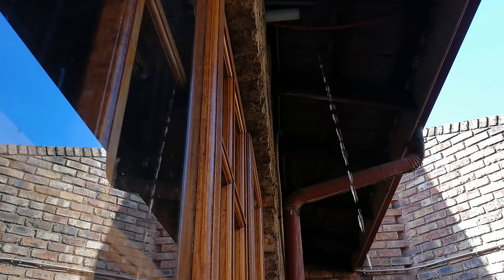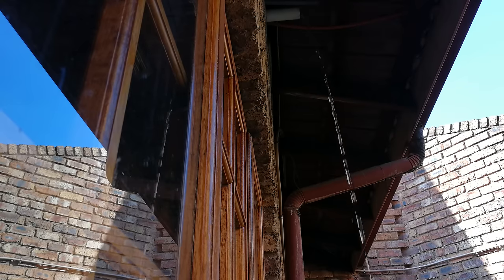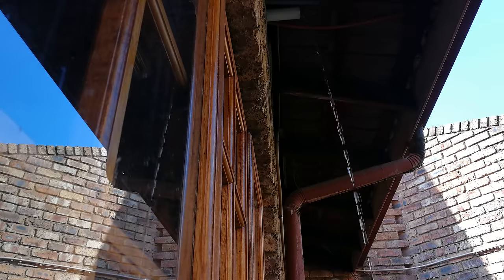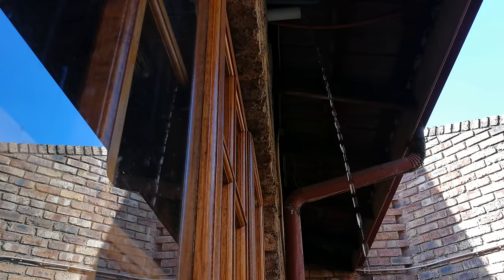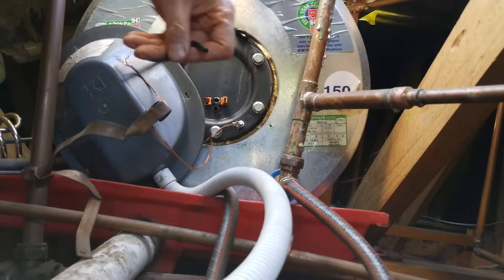As you can see the geyser is emptying — not at a high rate, just rolling out. I fed the drain cock connected via hose to a 40 or 45 millimeter PVC pipe which is falling to the ground. This will take about 15 to 20 minutes. Once it's finished draining, I'll start loosening the bolts for the element.